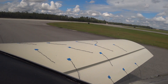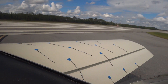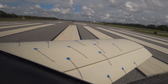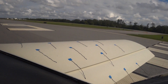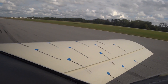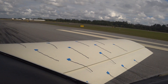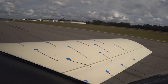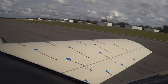This was preparation for camera angle and tuft positioning to see how things look — not planning anything approaching a stall. Having the tufts and camera angle to check ahead of time is important; you don't want to get into ground effect without the instrumentation you need. There was a solid crosswind of about 6 knots at 80-90 degrees from the runway. The aircraft sits at 6 degrees angle of attack at zero pitch, so it is generating some lift. The flow looks pretty laminar and I don't see any real problems.